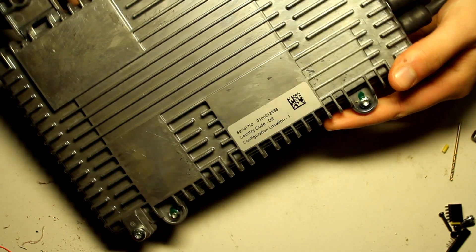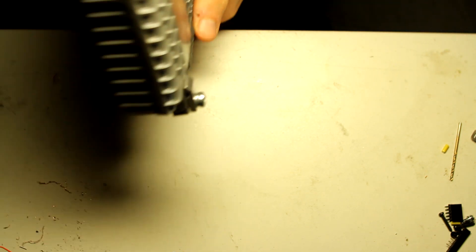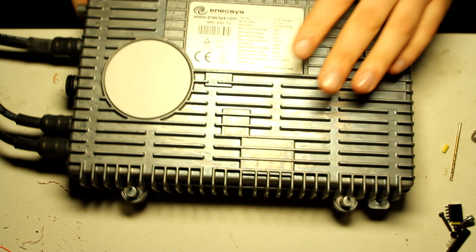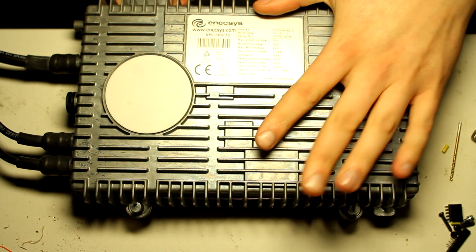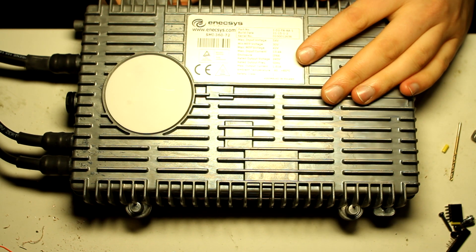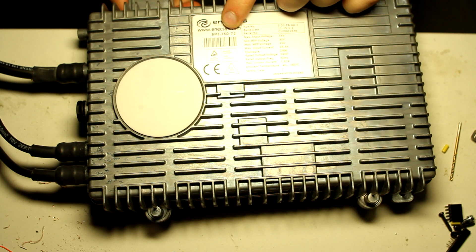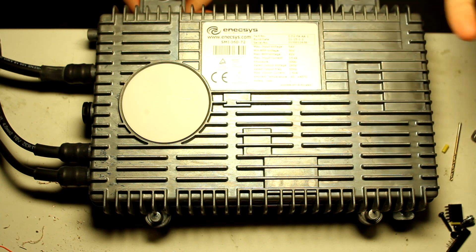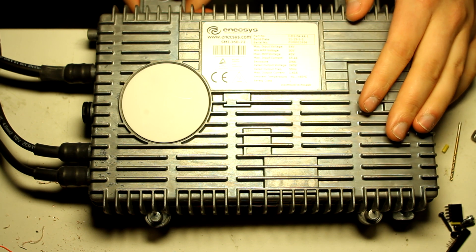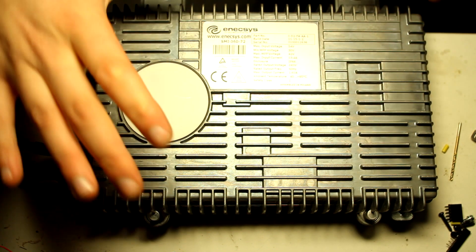This enclosure is a two-piece aluminum casting, and you can really see it's a casting - it's got casting marks and a couple of finishing marks on it. It's a really solid, well-finned unit. This will get slightly warm. They have very high efficiency; this one I think is 94% efficiency. It only has 360 watts rated power, so at around 95% efficiency that's only about 20-odd watts it has to dissipate as heat, so it doesn't need that much cooling. Obviously it's going to be near a panel, so it's going to be in a fairly hot spot.